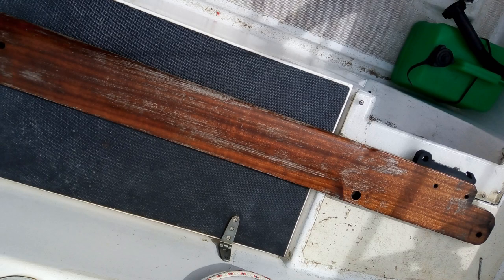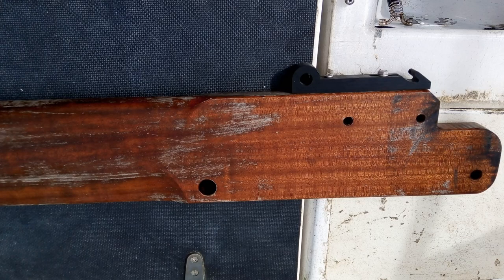The one fly in the ointment is the servo blade. We removed and dry stored the whole unit at the end of summer 2021 — it had only been on the boat for about 10 weeks, the time that we were away cruising. It was dry stored over the winter and then we refitted it at the start of our 2022 cruise. Very soon, the varnish finish on the servo blade began to deteriorate, and it actually got to the point where the blade would not lift up when it was released from the unit. We assume that the wood has swelled up a little bit, and although the pivot bolt was loose as it should be, it wouldn't lift up. At times it was very, very difficult to lift the blade up — that will need some work in terms of thinning the blade down and revarnishing.